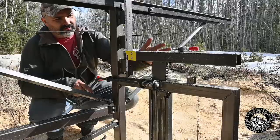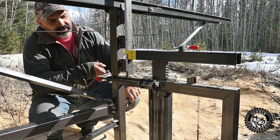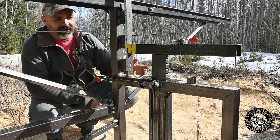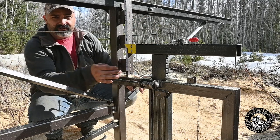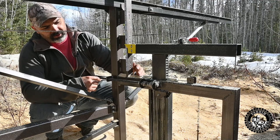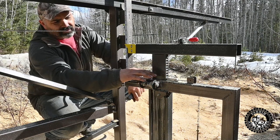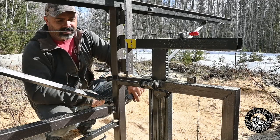Works great. This here log lifting system, it kept me up at night quite a bit, thinking on how I was gonna make it go with quarter inch stops, and to lock in spot every quarter of an inch, it lifts the log up. So you can make your dimensional lumber in quarters, inch and a half, inch and three quarters, 2 inch, whatever, 6x6 beams. And I mean, it works pretty simple. And I used the ArcDroid to put these slots here in the side, and then I just had to bevel them with a Dremel type tool just so that it wouldn't bind going up. And now it's pretty smooth.